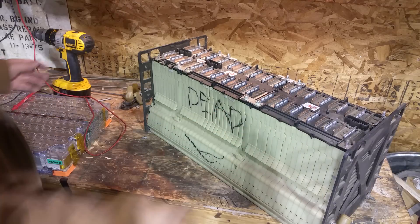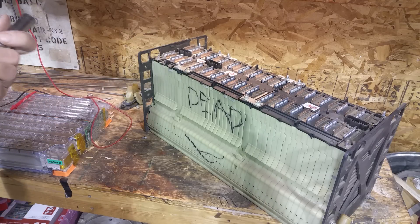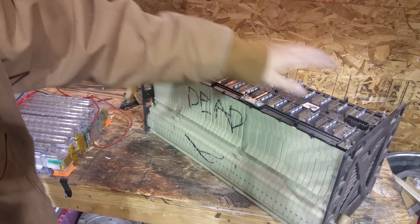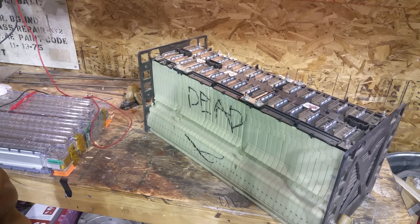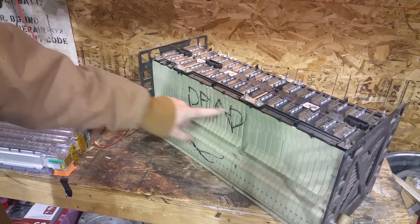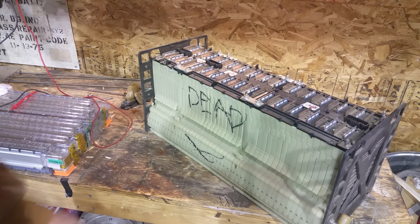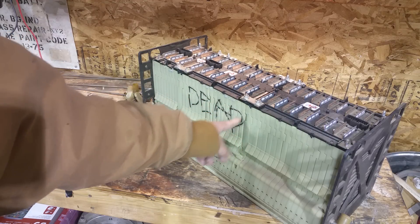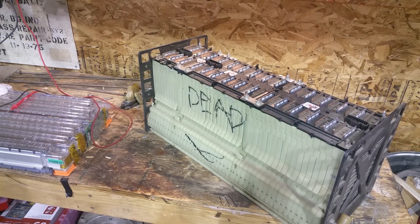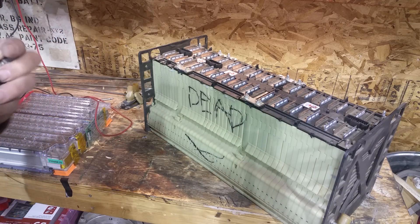This was the battery pack from the EV30. I was testing a BMS system for a company — I had approached them with a concept for a single-board BMS that would fit on each module to make it super easy to use the Volt BMS. We were testing that and apparently the board on this one failed and drained this entire module all the way down to zero volts. You can see it looks a little odd shaped here — I'm pretty sure these cells have swelled significantly, so I'm going to pull it apart and take a look.